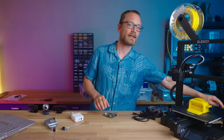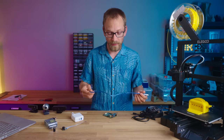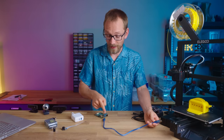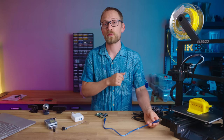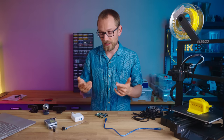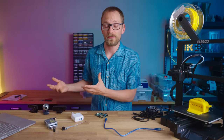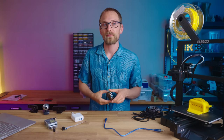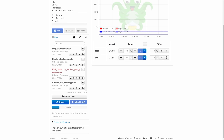Quick side note: some printers have a flaw in their electronics where they will backpower the Pi. If the Pi is plugged into your printer via USB, the printer can backpower the Pi the wrong way, and that can cause all sorts of problems — from OctoPrint crashing to the Pi's WiFi disappearing in software. I've put the link to the forum post about that in the description below. At this point, you are ready to start printing.